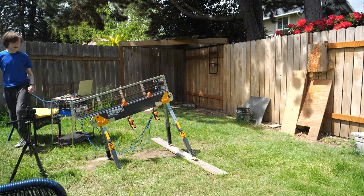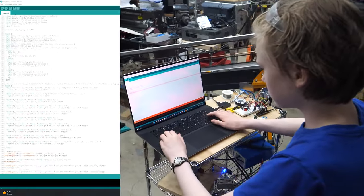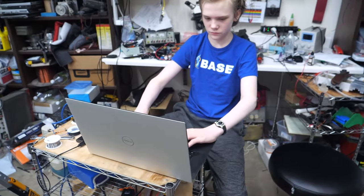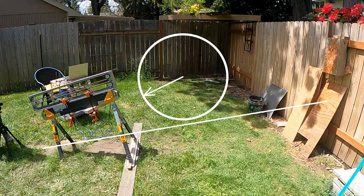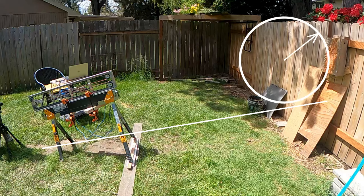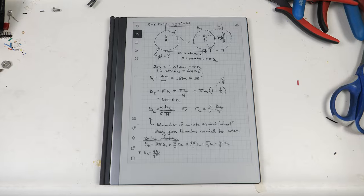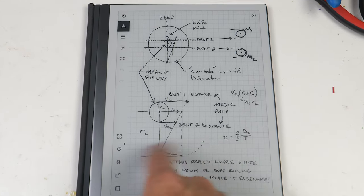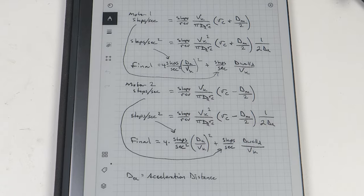By the way, my son legitimately is programming this entire thing. All I did was derive the formulas for calculating motor speed, which I'm beginning to question whether I got right or not. All I did was figure what diameter wheel would give 1 1/4 turns if it were rolling to the target. That would put our vertically oriented knife point forward into the wood. After that, it was just a bunch of triangles and a little algebra to find the ratios of accelerations and velocities of each motor, the average of those being the knife itself.